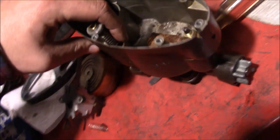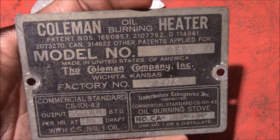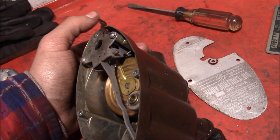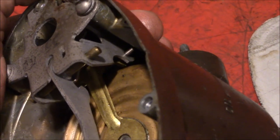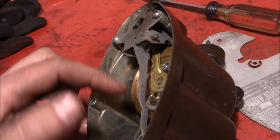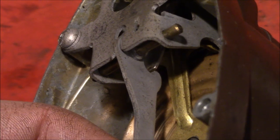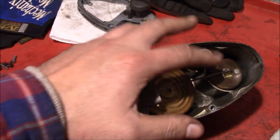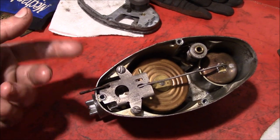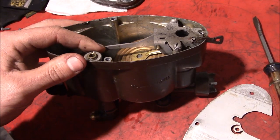Your fuel comes in this part right here, down to here. It comes up through the needle valve here whenever it's open, fills up the whole cavity. When you open up the control valve, it flows through the little notch down here, down through the bottom, and out there. Between the two valves here, as long as the needle valve doesn't get too gummed up, you shouldn't have any oil overflow problems. I bet a lot of times with a good cleaning — get all the grunge and sludge out of the bottom — you can usually get them back going without any major drama.